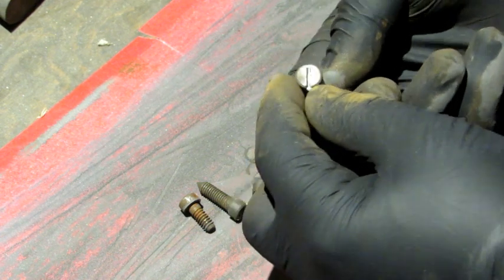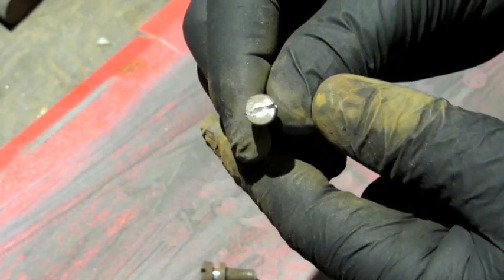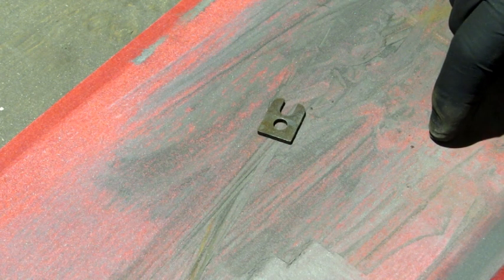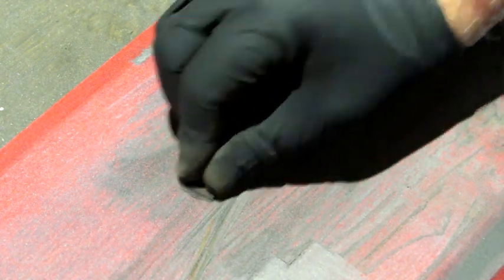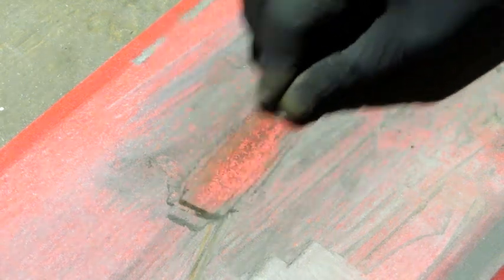Check it periodically to make sure you're not taking too much off — don't want to lose those machine marks. A lot of this rust is going to come off on the wire wheel, so just get rid of the burrs and leave the machine marks. This frog screw is a good example where I just took the burr off and you can still see the machine marks are there. If your frog adjustment plate has a lot of rust like this one does, it won't clean up well on the wire wheel by itself — bring it to your lapping station, keep it flat, slide it back and forth, and check it until you're happy with the results.